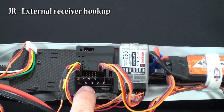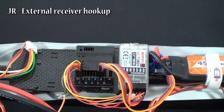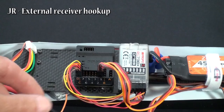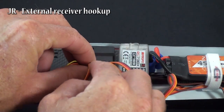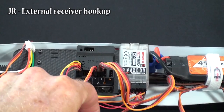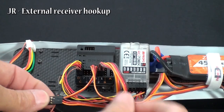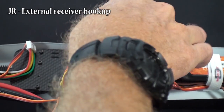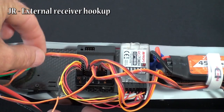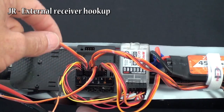Next are plugs 3, 4, 5, and 6 — these are the plugs for your servo rotors. Plug 3 is your front left rotor, plug 4 is your left rear rotor, plug 5 is your right rear rotor, and plug 6 is your right front rotor. Take your left front rotor and plug it into plug 3, left rear rotor into plug 4, right rear rotor into plug 5, and right front rotor into plug 6. Plug 7 is just an extra port you can use for other things. Note: the ground is out towards the numbers and the signal wire is facing the other way on all your plugs.